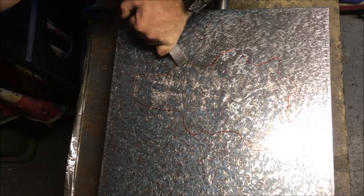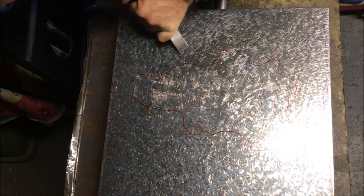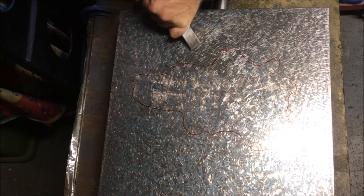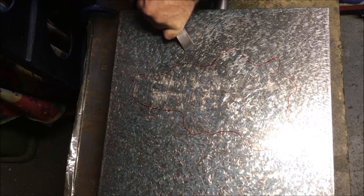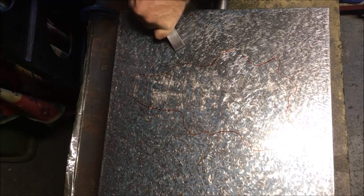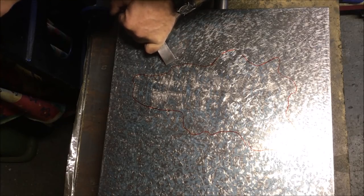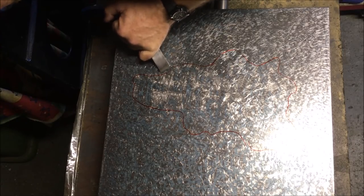He is considerably better than I am, and I'd like to see him do another one where he actually scrapes and then goes down to flaking. But he's starting on, I think it's a 15 inch straight edge that he's ground, so it's already within plus or minus half a tenth, so he's not got to make any adjustments, which he openly says. So all he's doing is effectively breaking up the surface to use as a bearing for print.